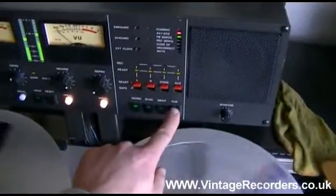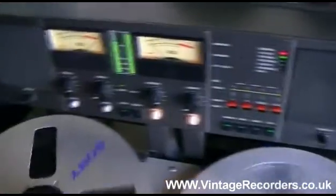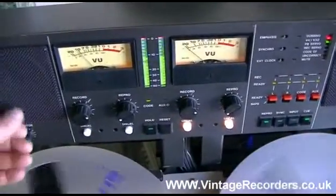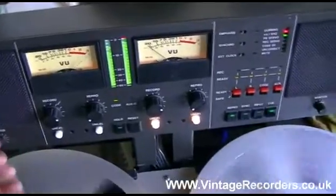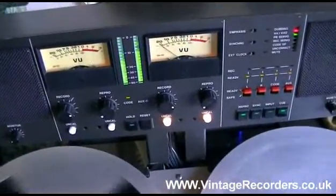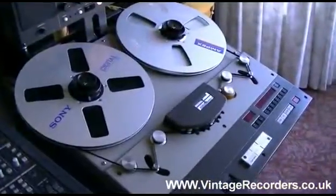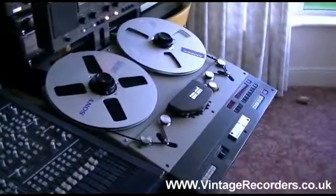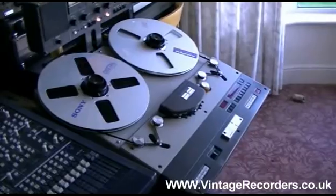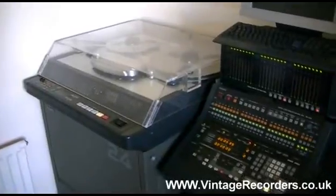If we go to the Q-Tracks — you don't use Q-Tracks for replay, you use it for edit only. The ProDigi is a different kind of format to the DASH machines. It's a Mitsubishi format only, and I believe it's not compatible with older or newer machines. The Sony's tapes will work with the A-Series, S-Series, and HR-Series.